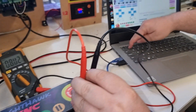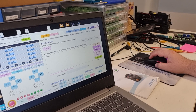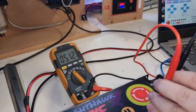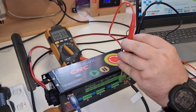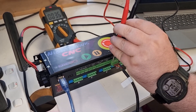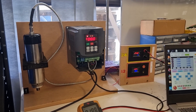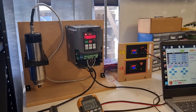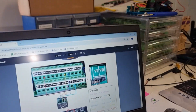Changing the value from maximum to S12000 — which we have programmed — drops it down to five volts, and you can hear the spindle decelerating. Hitting the Stop button in Commander brings it back to zero volts. That confirms this Nighthawk is definitely outputting the correct zero-to-ten volt signal. If your VFD still isn't responding, a very common mistake is not switching the jumper — it needs to be on VI, not VR, as covered in the manual.